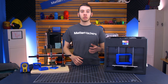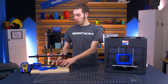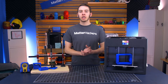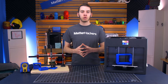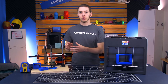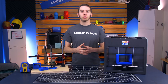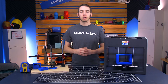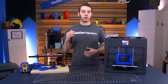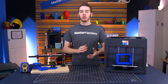There are a lot of different ways you can incorporate jigs and fixtures into your project, whether it's something simple like a box to hold your part in place as you solder it or something more complex. The key takeaway is that a jig is something you clamp to your part, and a fixture is something you take your part and clamp it to. Once you figure out whether you're using a jig or fixture, it should make your project a lot easier to manage. I'd love to see however you're utilizing jigs and fixtures, whether it's something new from this video or something you've already been doing for a long time.